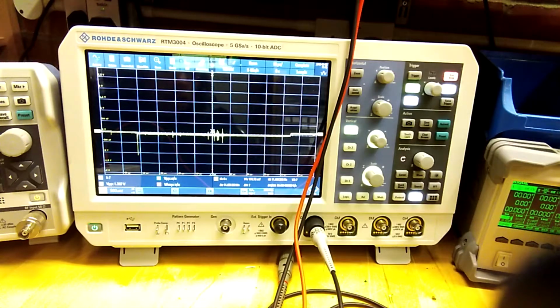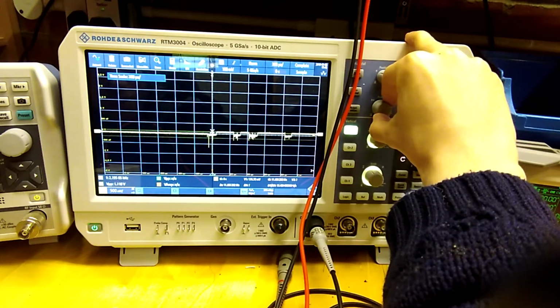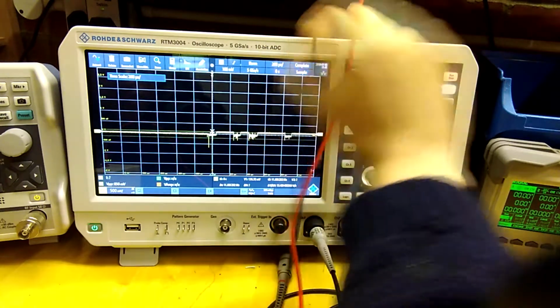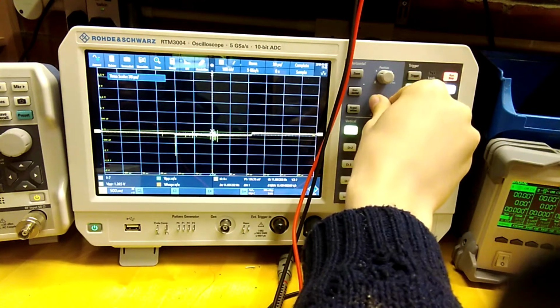Again, they don't conduct exactly at 0.6 volts. It's a little bit ahead of that, depending on the current flowing through them at the time. It is limited pretty greatly, however, by that resistor and capacitor, the capacitor being the highest impedance part of the circuit. And this is what the signal generator would be seeing if everything went wrong. So you can see the very fun little spikes that happen. This is probably due to the switch more than anything, really, I imagine.